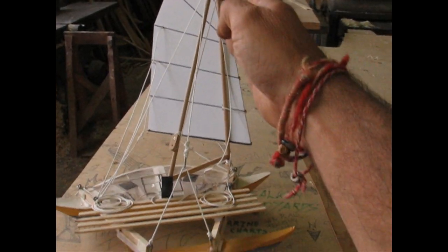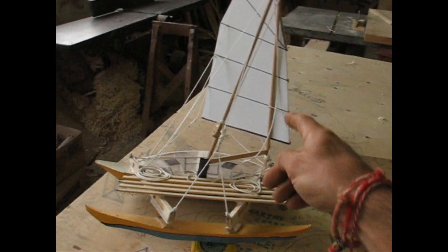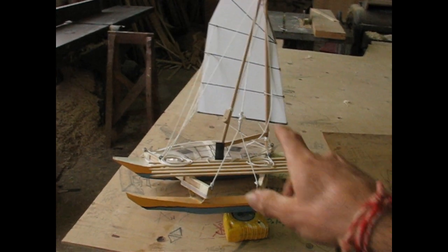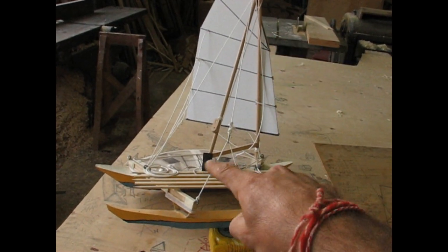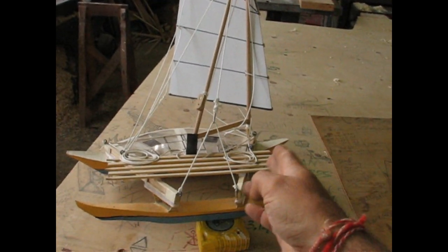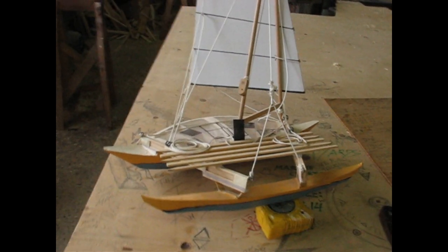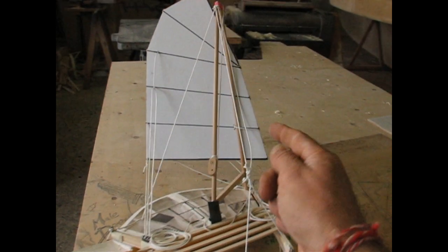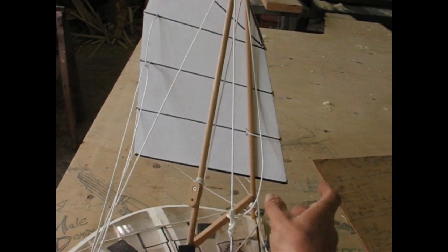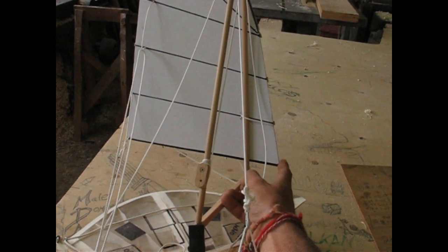Let me explain terminology: I call this the yard and that one the mast. A yard is a spar that holds your sail but it moves — it's not fixed to deck. A mast is fixed to deck. So the yard has to move back to somewhere over there, giving me a lead of 7%. The good thing about junk rigs is if it's too much, all I have to do is tighten the luff parrel and the sail moves back.